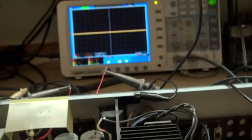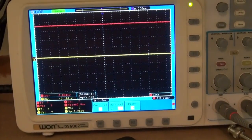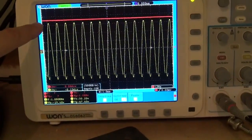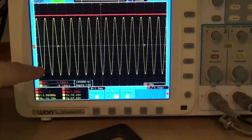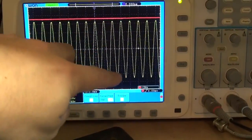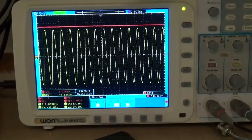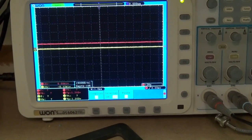I'm feeding a 1kHz signal into the receiver with it powered off, and now I'm turning it on. Immediately one channel went to DC and the other channel is working fine. You can see how one channel is sitting at the top of DC — that's the bad channel. The other shows the normal plus and minus sine wave waveform on the good channel. That DC offset is exactly what causes your speaker to self-destruct.